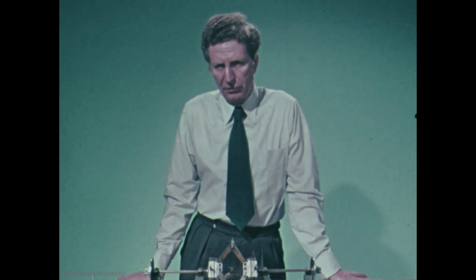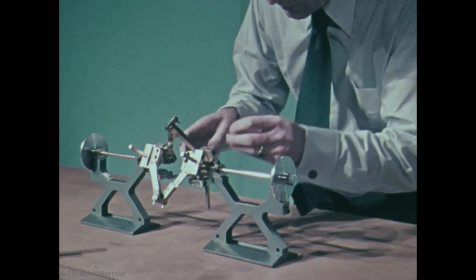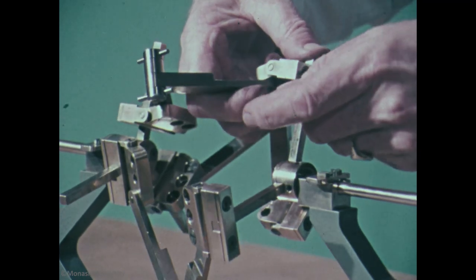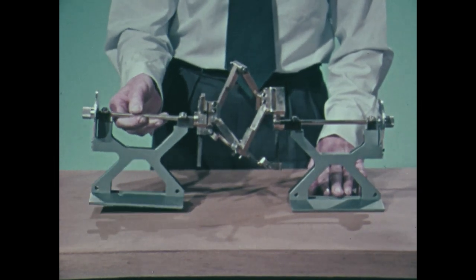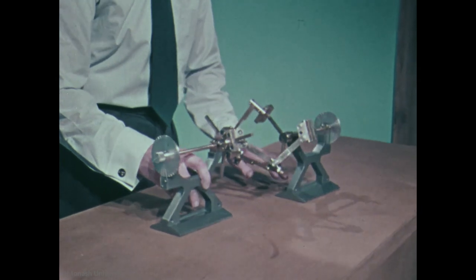For the coupling to work properly, we must resolve this dilemma. And we can resolve it, if we want a parallel shaft coupling, simply by removing any local symmetry and at the same time unambiguously establishing an imagined plane of symmetry at infinity. This we can do by altering the settings of the mounting blocks so that each connecting chain is tipped over. When all three connecting chains are reset, no local symmetry remains. And give or take a little looseness in the joints, the shafts cannot angle with respect to one another, but they are free to shift parallel with one another, and at all times they're constrained to remain parallel.